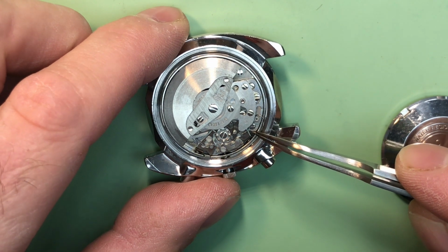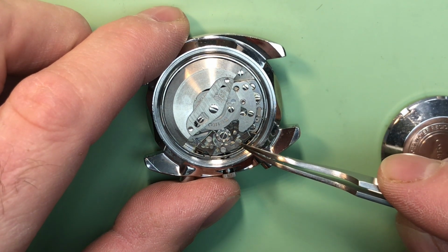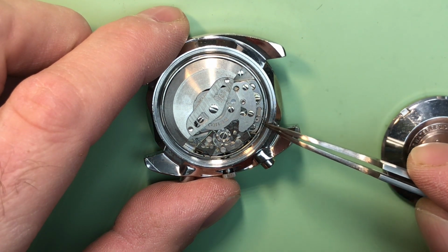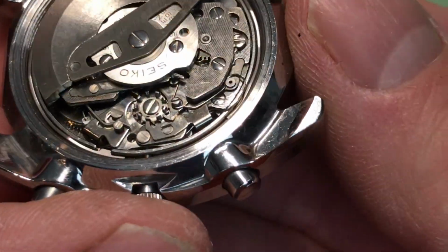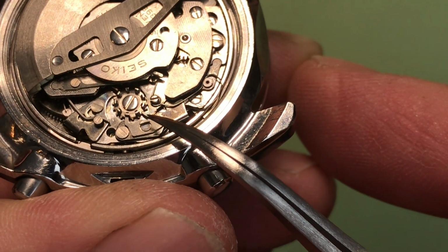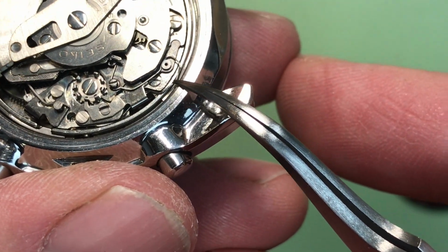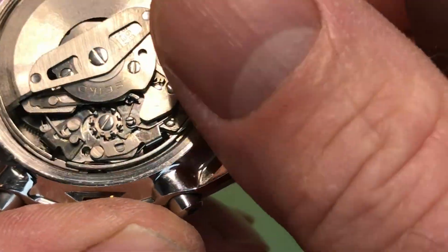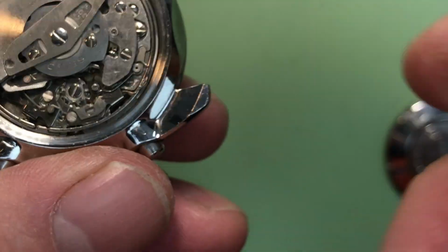Wow, what the heck is that? That's wrapped underneath of the hammer pusher. Okay, well, first indication of something awry is this spring right here. That is not correct. I don't know if you can see that very well, but there's a spring right here, and that spring should come straight and clip on the back of this post. But yours is actually bent and out into the ceiling area of the case, and down underneath has been squeezed underneath of this thing, which is what's actuated by your reset pusher that operates your hammer. That is not what you like to see.